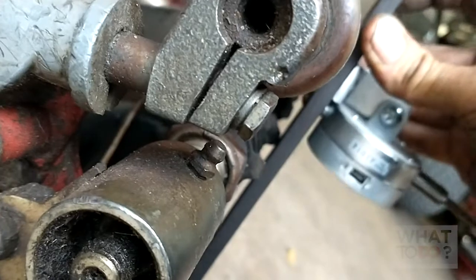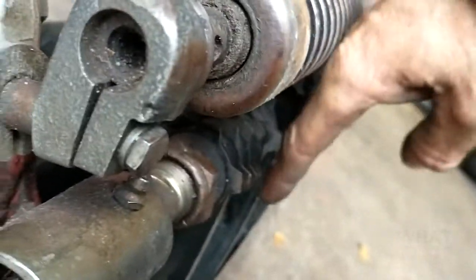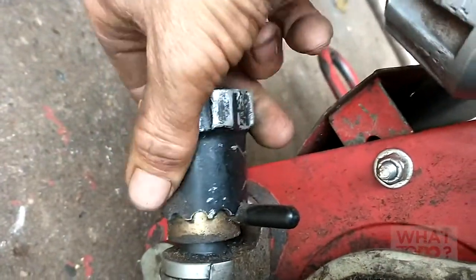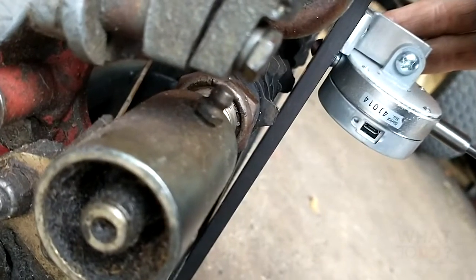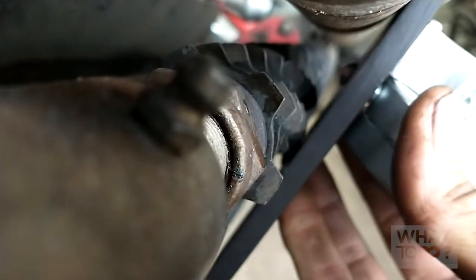So now when this spins you would just be skimming the turf with that groomer. What I like to do is take it just a tad more lower so that it's just sticking past the roller a little bit. That'll be good — as you can see that would dig into that level if that groomer turned. Let's put our level up here and see where we are. All right, so that would be a good spot to start.